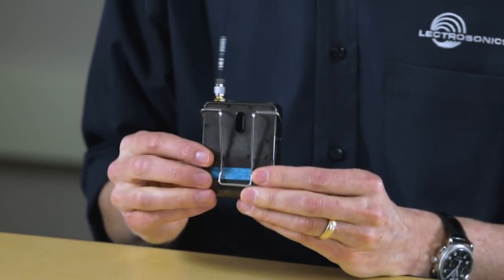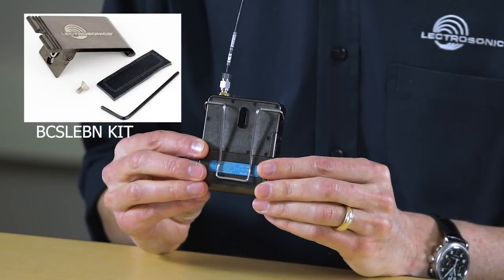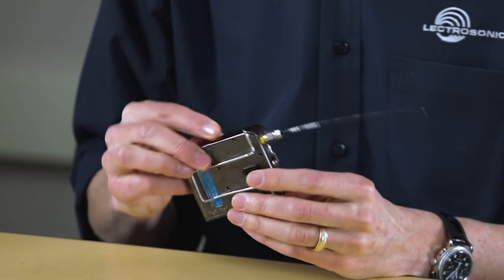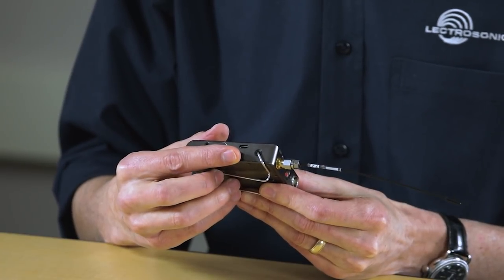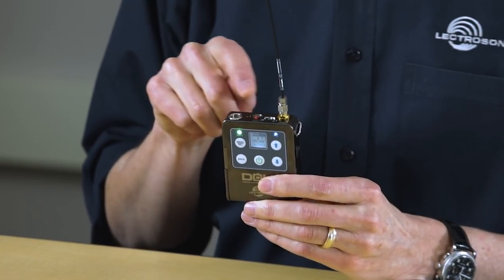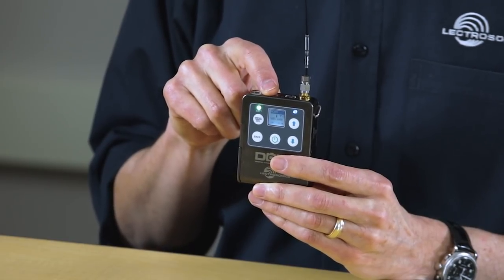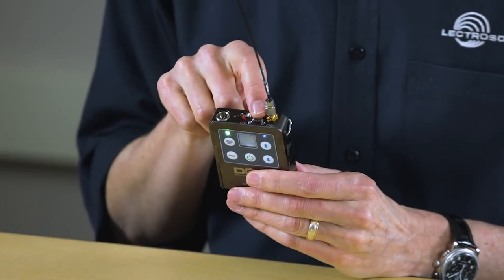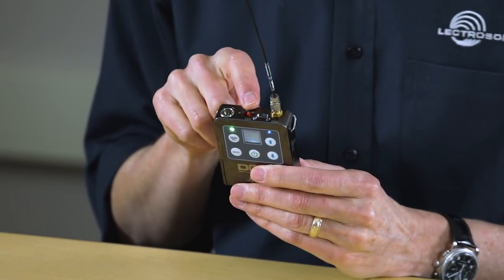The DCHT comes standard with the same wire belt clip as the LT, but can also use the optional BCSL-EBN clamp style belt clip for when you need to attach it quickly to something or someone. Here on the side is the USB jack allowing for firmware updates in the field. On top of the unit, you can see the standard SMA type antenna connector and also the programmable switch. The switch can be set to turn the unit on and off, or as an audio mute with the RF carrier still on. Then there are the channel input activity LEDs — green to red with analog sources, and blue when digital inputs are selected.